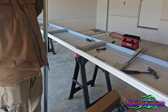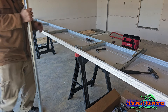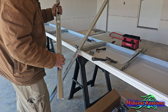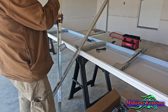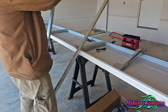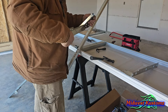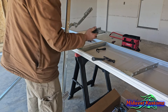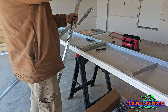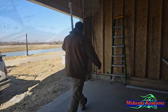I put these up left and right on each side of the opening. On these, the smaller bracket goes on the middle slot and the bigger one goes on the bottom slot. On the 9100 it's bottom then top — if you've seen that video. Make them as straight as you can. Now for our top slot, put these in the slot. Small plate or small bracket in the middle, big one on the bottom of the top slot.